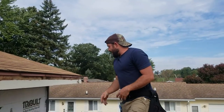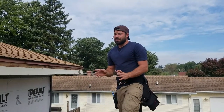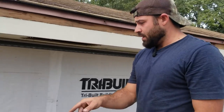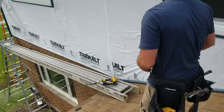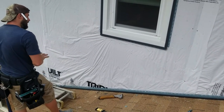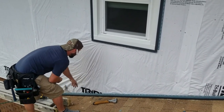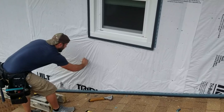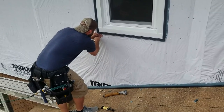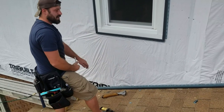And that's what happened, is maybe one or two steps got missed. Maybe one person was getting too rammy. A number of things can happen and really screw up your whole side, especially with these angle cuts right here. So you're going to be throwing these angle cuts in here. And when we get to them, I'll show you exactly the mistake a lot of people make. The piece has to relax in there. It can't be forced, because for some reason, with this long angle, you can manage to stretch the hell out of it. You'll see it starts to go like this. It starts just working its way up. And before you know it, you've got like 4 inches here, and 2 inches over here. And you're going to have this cocked window.